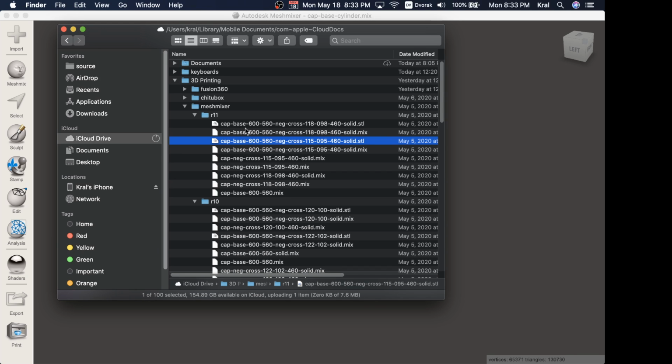circular, the diameter of the circle, and then 5.6 millimeters, no, okay, hold on. 5.6 millimeters diameter, and then maybe 6 millimeters tall. And then the hollowed out part in the middle is 1.15 millimeters. These are like the arm widths. So one of the arms is 1.15 millimeters. Let's just take this file in here and you'll see what I'm talking about.